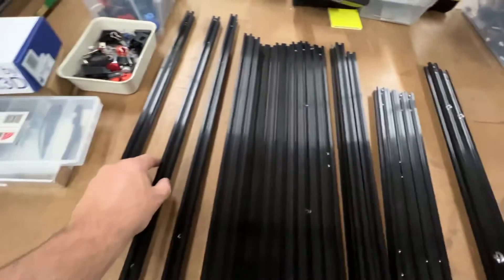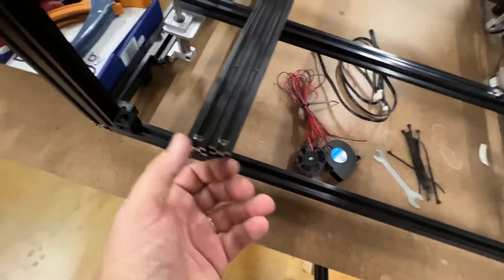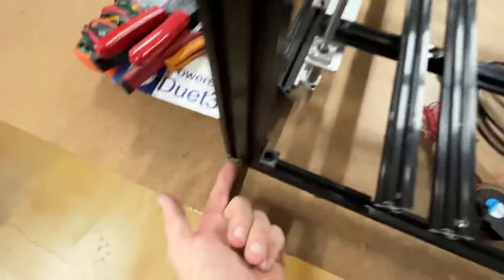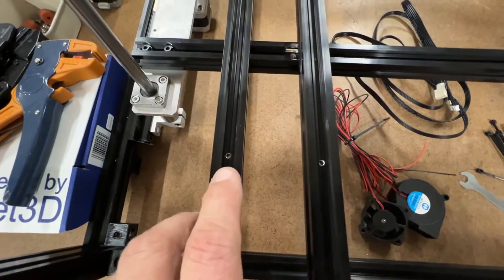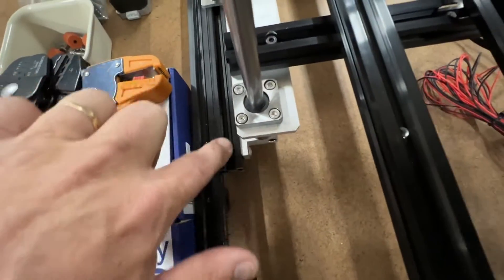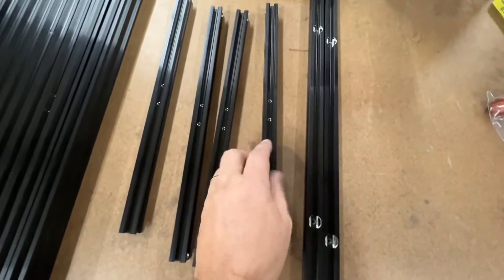So these are the left and right bottom bars. They will attach with this hole facing down — your screw goes up into the corner right here. These holes are for rubber feet, and these holes right here mount to this bracket. We're going to have four of these — one, two, three, four — and they should all be the same with the same hole patterns.